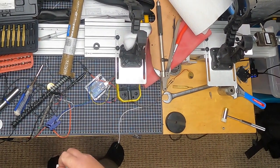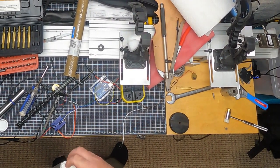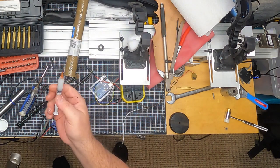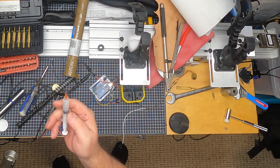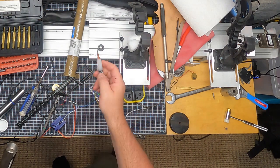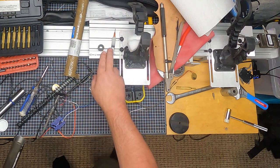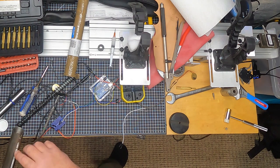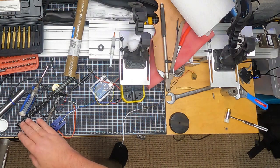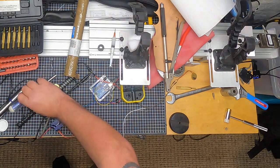I'm going to run a paper towel down here and just kind of get a lot of that thick, heavy grease out of there. What I'm going to use instead is some Super Lube — this is a synthetic silicone-based grease with PTFE in it. Really all this is going to do is lubricate the slider going back and forth. I'm not going to do anything with the piston seal that Paul Short has made, presuming he's already lubricated it before sending it to me.